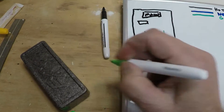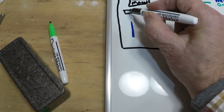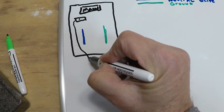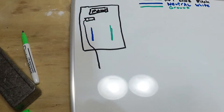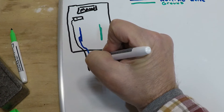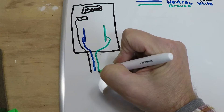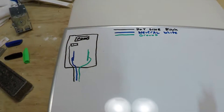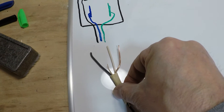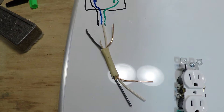What happens is you've got your wire going from the breaker — which is the hot, where you can flip it on and off — and your wire comes out and goes to your outlet. You've also got your neutral wire coming out, and your ground wire coming as well. Let's put an electrical outlet over here to simulate what's coming out of the panel.